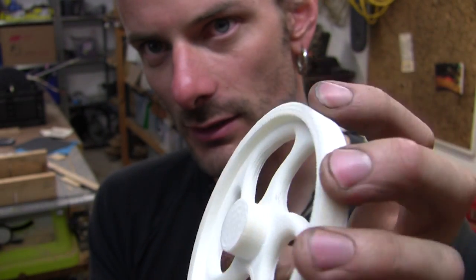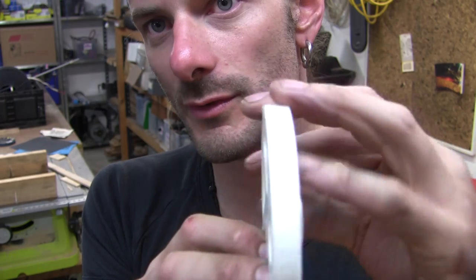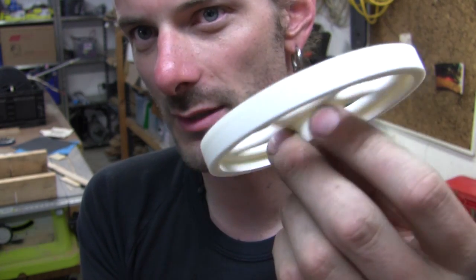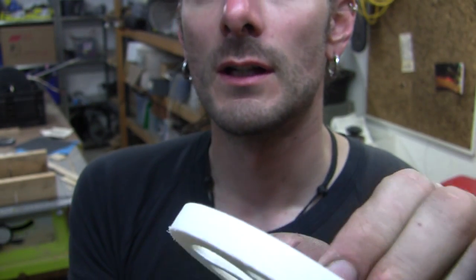I think that was actually due to — if it was sanded, or even vapour smoothed, where you put acetone vapour and it actually slightly melts the surface, and the surface tension makes it almost look like an injection moulded part. But you do lose some dimension and that kind of stuff when you do it. That would enable you to probably keep a standard draft angle, but I think I had to use 7 degrees of draft on this to get it to pull out very cleanly.